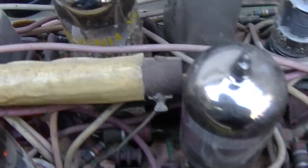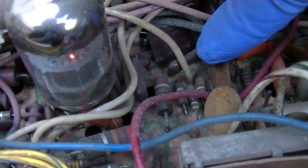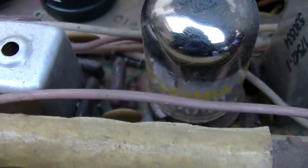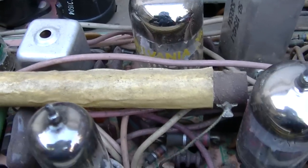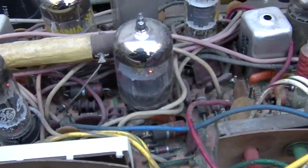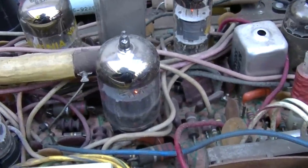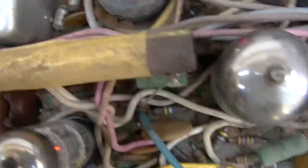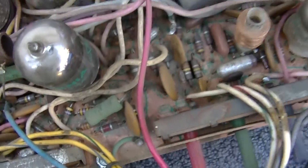I'm just kind of looking at this and I'm noticing one difference. This has mica capacitors in it, and these are expensive, these dipped. This other one has those silver polypropylene, I think they are, and those are starting to fail. Back to this one. See the type of capacitors this has? See those little silver things? I worry that those are bad. Anyway, you can see the difference.